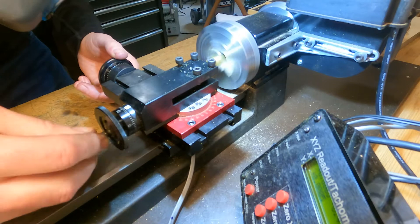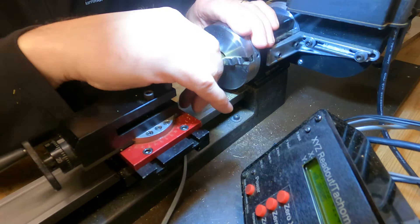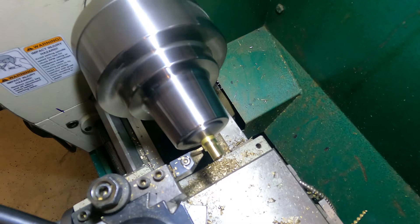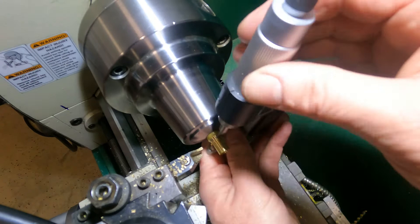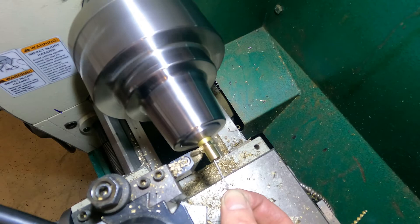The picture is not great but I've got a boring bar in here and I've got this set at about a one-degree angle on the cross slide, so that now has a taper fit. I'm checking it on a gauge pin — use a gauge pin to see how that is — and now I just need to put the shoulder on this and cut that part off. It's getting pretty close to finished. Just make sure this shoulder is the right dimension, come in there with a mic. I apologize for the photography — not a great shot here but you can get the idea.